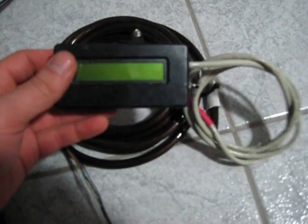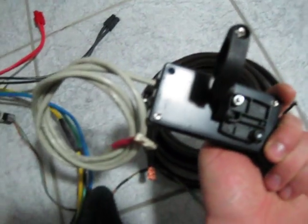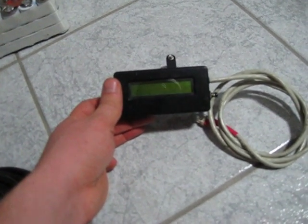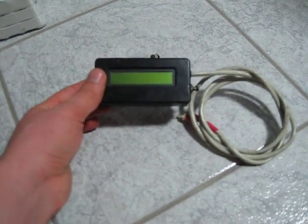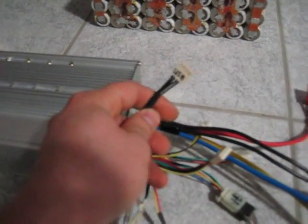I'm not gonna open anything but the Cycle Analyst here — I did a lot of work to it. This used to be an external shunt Cycle Analyst. I modified it to a direct plug-in. While modifying it and trying to reprogram it, I managed to screw up the microchip inside — the processor that stores all the data for the software. So on this one I did a lot of surgery: I removed the chip, replaced it, reprogrammed it, and also modified it to run 200 volts. It works perfectly — it hasn't burnt out surprisingly. I've tested it up to 144 volts direct plug into my controller.